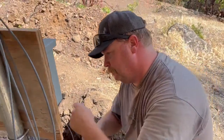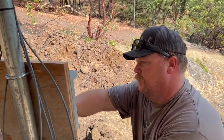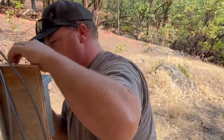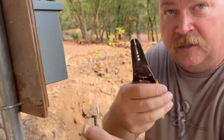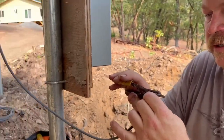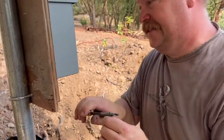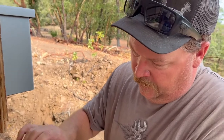More cleanly wired arrays are definitely safer for a number of reasons, especially when you're out in the middle of the woods with lots of rodents. So we cut our wire — just solid copper strands in there. We're going to take our wire strippers and find the appropriate size, and we're going to strip approximately a half inch of insulation.